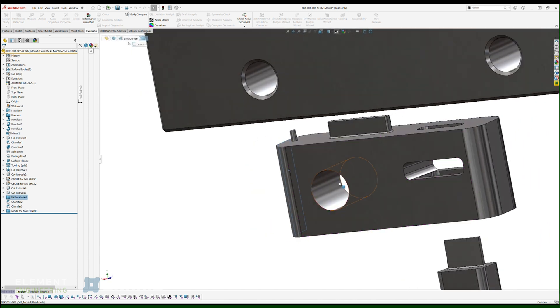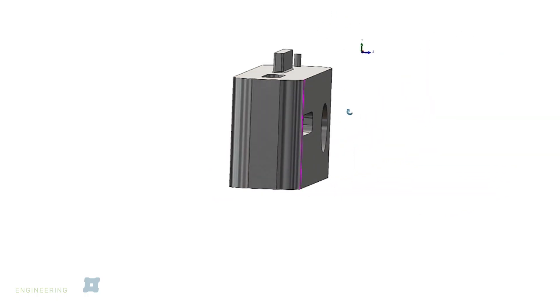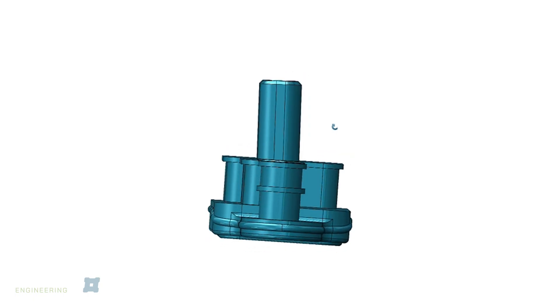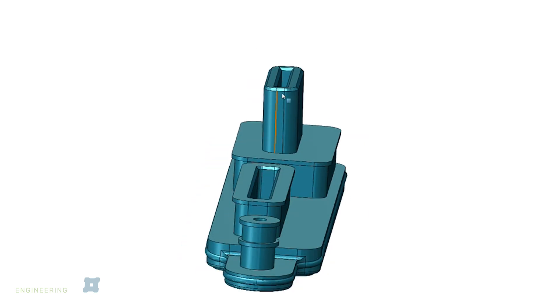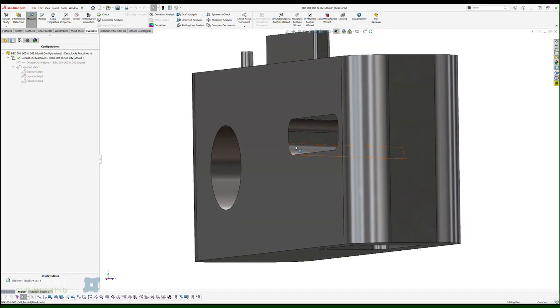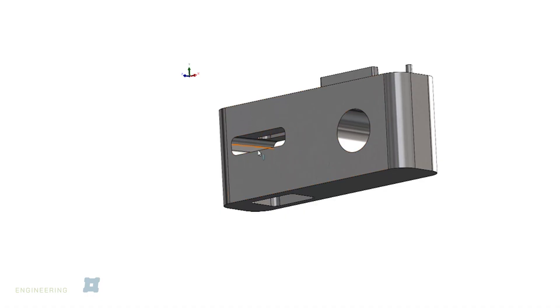This thing here is only about 25mm long. This pin in here is about 9mm and this feature on the side is because it comes through on an angle — that pin is on a slight angle. There's a draft angle on here because we designed this so it can be injection moulded. We're currently machining on the five axis which gives us the ability to easily put that draft angle on. This feature that is going to be the negative of this has to come down at the three degree draft angle. We're putting this pocket on an angle to give us a flat surface where the liquid silicone rubber will actually sit on.